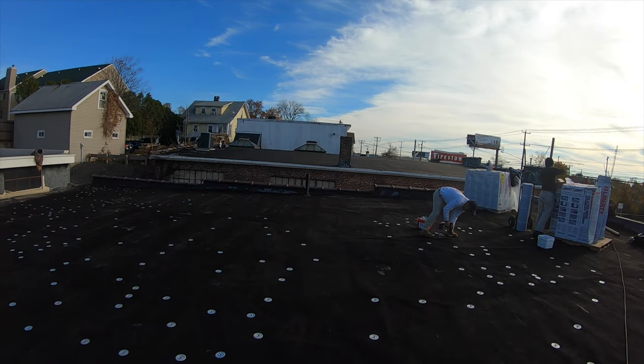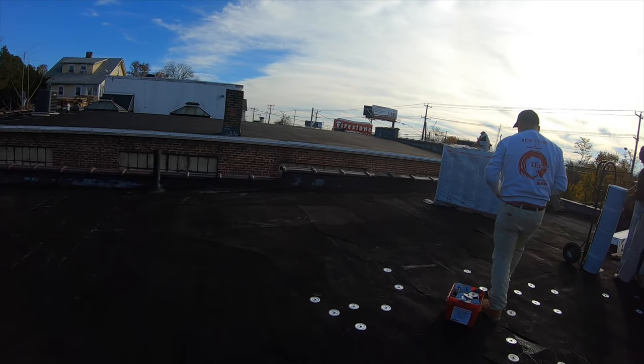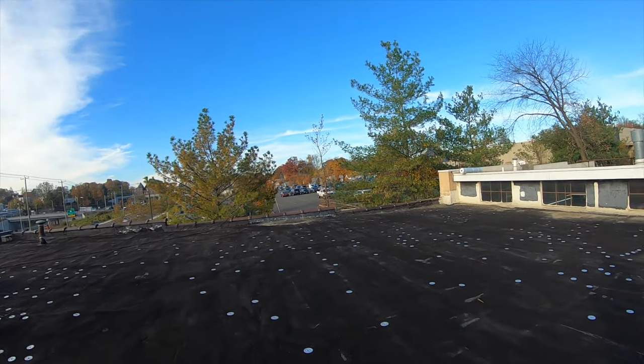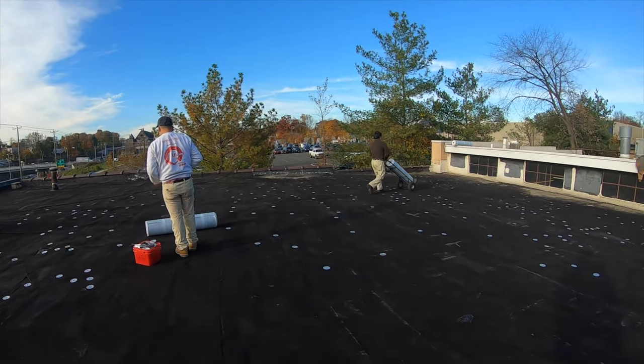Maybe you can compare it to the roof on the other side. You can compare it. And you can see this is going down because look at the parapet wall. So this is a slanted roof, okay? It has about a four pitch. I'm not sure. But it's pretty pitched, and so that's why the peel and stick will work very good.